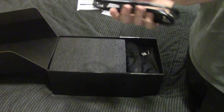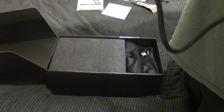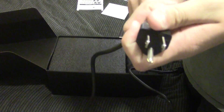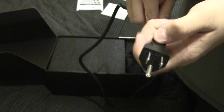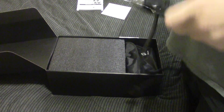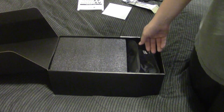Here we've got a nice thick power cable. I'm pretty sure this is 14-gauge, which some companies are shipping as 12-gauge cables. Even with my limited knowledge of electricity, this is a 15-amp plug, and the cable standard for 15-amps is 14-gauge. So using 12-gauge power cables on 15-amps is unnecessary. If one of the prongs is sideways — implying a 20-amp outlet — then yes, 12-gauge is necessary. But if somebody ships a 12-gauge cable with a 15-amp rated plug, they're making you pay more money than you need to.